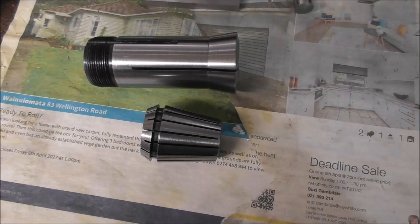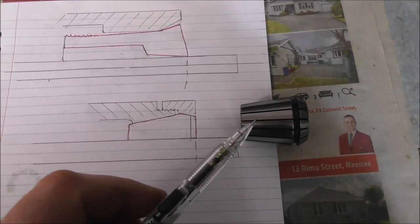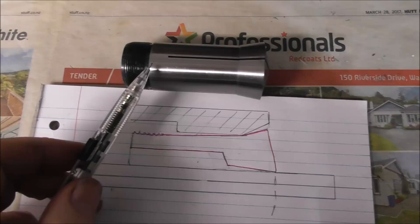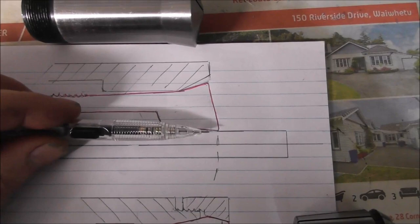That's a double advantage. There's quite a bit of debate on ER collets versus 5C type collets. The 5C type collets pivot at the back and then tip forward. Clearly, if you're gripping on a diameter smaller than a specified diameter, it's not a good idea, because this happens and it only contacts in the front edge, and you get a gap back from there and a gap here.